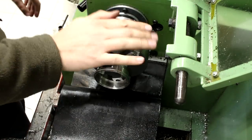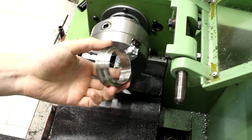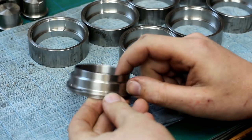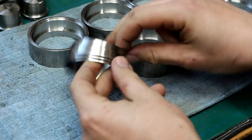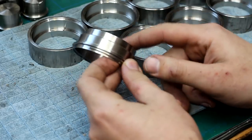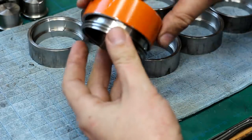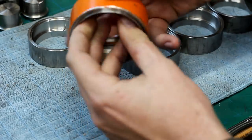There we go — that's the final part, coming out of the lathe. Done. One beautiful part. That's the first of these threaded adapters done with the blunt start thread — and also a blunt end, because we don't like those razor-sharp thread ends. The master cap is a very nice thread-on fit.